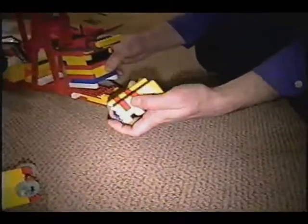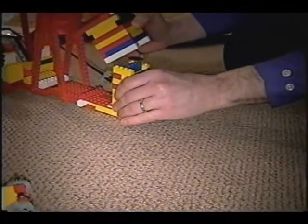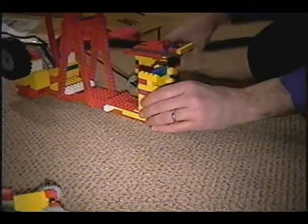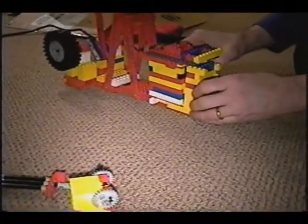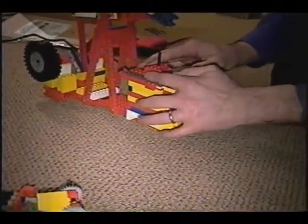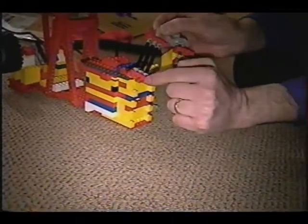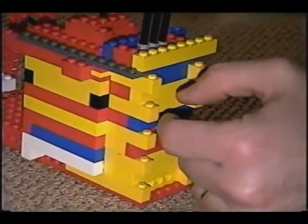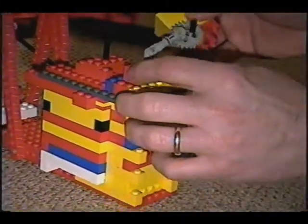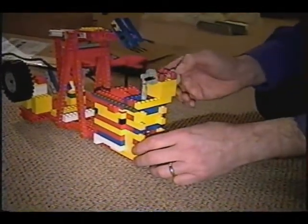Here's my valve chamber — that's got to go on first. I slide that into position. Things have all been out of shape since I took it apart. There's my valve chamber. Get this back where it goes, slide that back into place. I'm going to slide my valve down into its valve chamber right here. These little extra bits are just to keep the valve plates from snagging and catching on that opening as they go past — otherwise they tend to catch and get stuck and cause the engine to jam up. So those keep it from doing that. This is the valve mechanism for the engine.